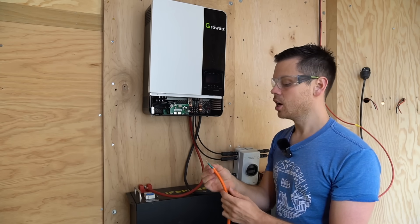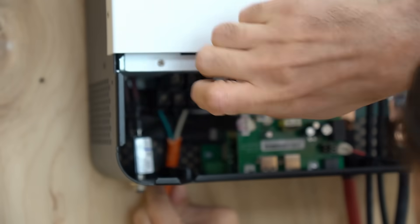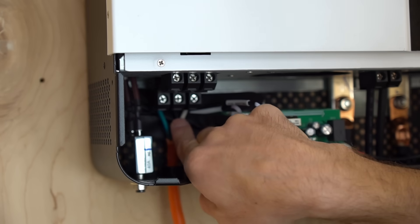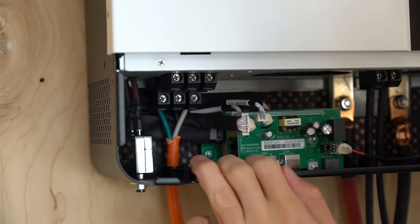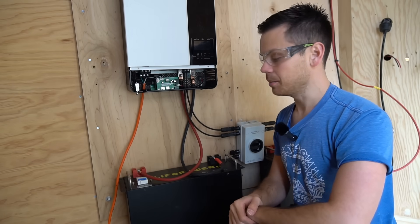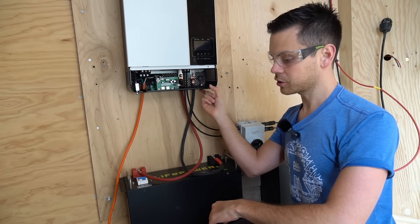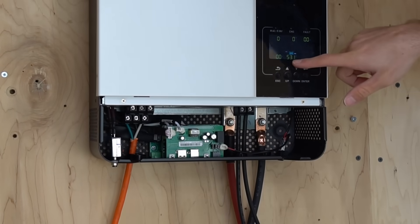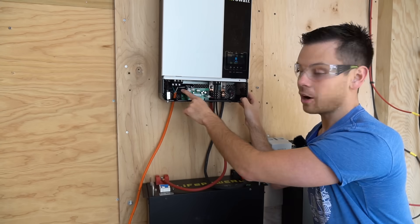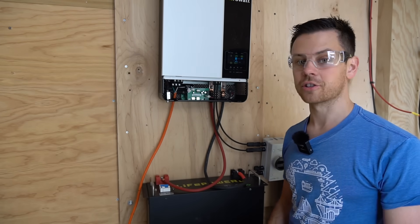For my system I'm only using this to power an air conditioner, so I'm going to wire it up with an extension cord as an example. Push it up through this little hole. We have the ground, the live or hot lead in the middle, and the neutral or white on the far right. Now we can plug the air conditioner right in. Now that everything's connected we can safely turn the battery on — flip the breaker, then turn on the all-in-one system with the small switch. The screen is on and shows the battery voltage. After about a minute it will turn on the inverter output, and these terminals will then be live with high voltage, so be very careful.